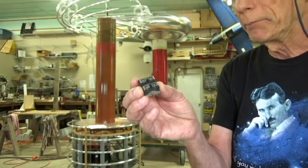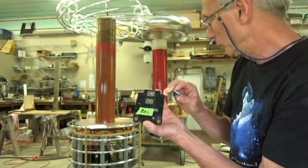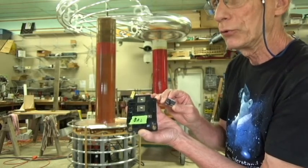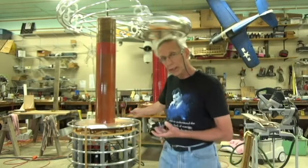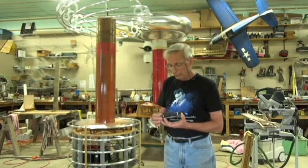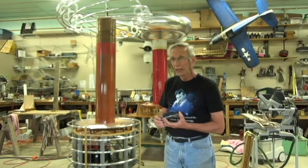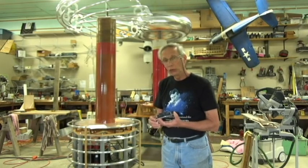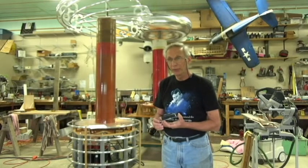Here's a comparison between the two. In this Tesla coil switching design we're using four of these switches, and each can handle about 600 amps per piece as a pulse. As a result, the maximum current this thing can handle is roughly between 2,500 and 3,000 amps per pulse — a tremendous amount of current. It runs at 240 volts single phase and only uses about 40 amps at 240 volts to run it.